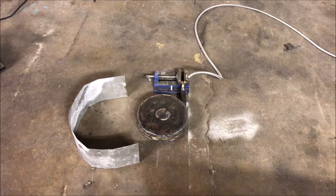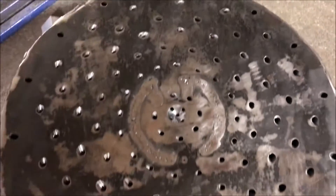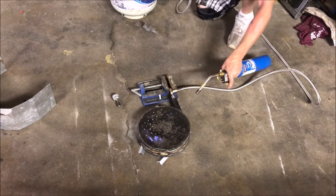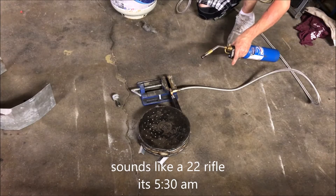We need a high velocity flame. I'm about ready to go with a blower on this thing. However, if we put more holes in there we'll reduce the velocity big time. I just drilled about 60,000 holes at an angle — and I don't like it.